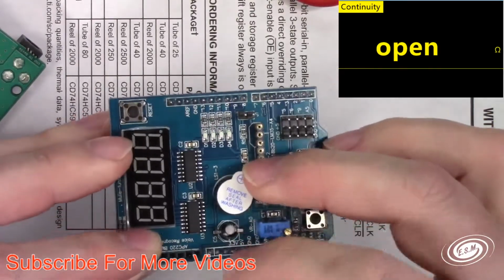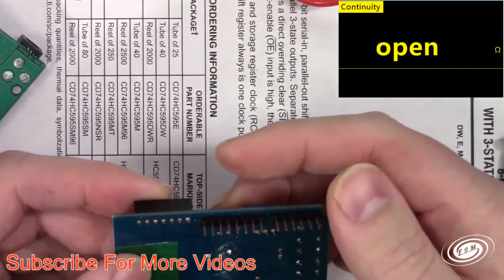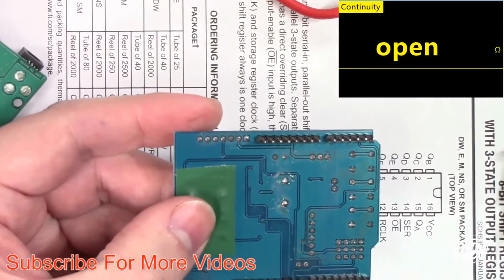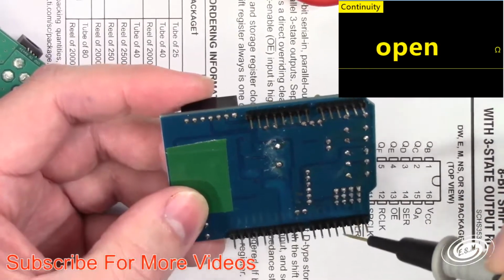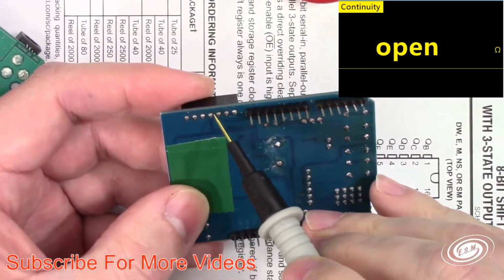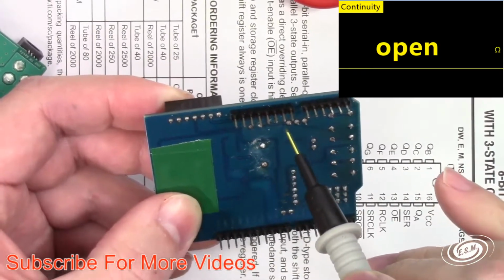So it appears that that is the fourth one. Yeah, it appears looking at the bottom track here. Let me brighten that up a little bit so you can see. It appears that this bottom track does indeed shoot over here. So this is the fourth one over, so that's pin one. And alright, yeah, looking at it that way, so minus, plus, which makes sense, it goes to the plus pin.